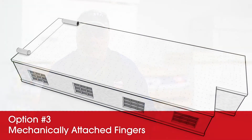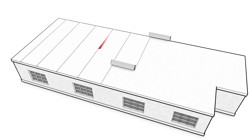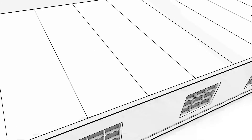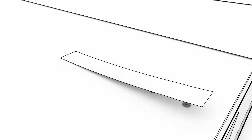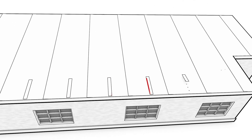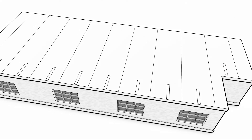The third option is fingers on top of the sheet, stripped in. Again you have two half sheets on the short ends, you run your full sheets out to the edge, then you take your regular plates and fasteners and run them through the top of the sheet. Then you take an 8-inch flashing strip and strip it in — that's best done by the robot, which is the most efficient way — and then you just have two little 8-inch ends to hand weld. For this job we decided to do this: we put the fingers on top, fasteners on top, flashed it in with the 8-inch flashing strip, ran the robot, did the ends with a hand welder, and used cut edge sealant on the cut edges. For this particular instance, we felt that was the best way to go.